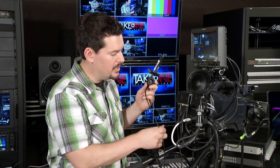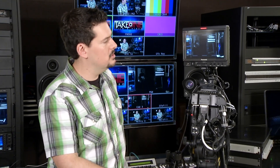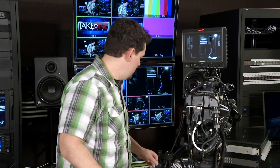If you have a real studio camera that you've been using or are used to, you know there are a couple things about studio cameras that make them unique. You have tallies, you have intercoms, you have your viewfinders, you have return videos — those things are crucial to a studio system, and Panasonic did not compromise on that. You get all of those features in this box. As you can see here, we have our intercom that's two-wire and four-wire compatible, so whether you're RTS or Clearcom, you're covered already with this system — no compatibility issues. The tallies are also a great feature; if I tally my camera, we get it on the studio adapter, we get tallies onto our monitor, and your talent will be able to see it as well, because there are two LED red tally lights. Return video is also included, so that you can see what's on program to know how to frame your shot. There are no compromises — you get the full studio system in this kit.